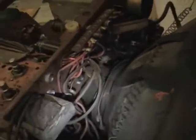There's one way back in there on the tuner. A blue guy back in there. I think that will be quite challenging to get out, so you have to actually unmount the tuner to get at it. So I think I'll just leave that one in for the time being. I don't see any back here. So they used a lot of ceramic disc capacitors in this set. Probably accounts for why it is working pretty well without me having done a recap on it yet.